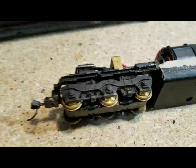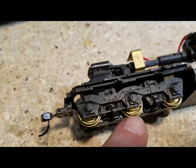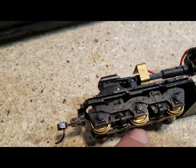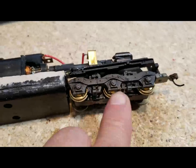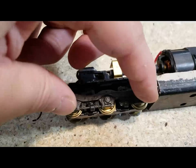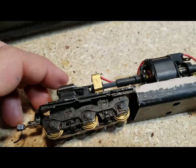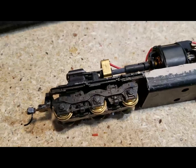These are the old metal side frames with brass wheels. On the middle axle, I think I might have already corrected this once — you need some up and down movement on the middle axle to keep it on the track. If you give it some play in there it'll stay on the track. When it gets to a rough spot like going over switches, you want the weight of the locomotive on the outside wheels and the middle one to float — that keeps it on the track. Without that, you have three points of contact and one wheel will jump the track.